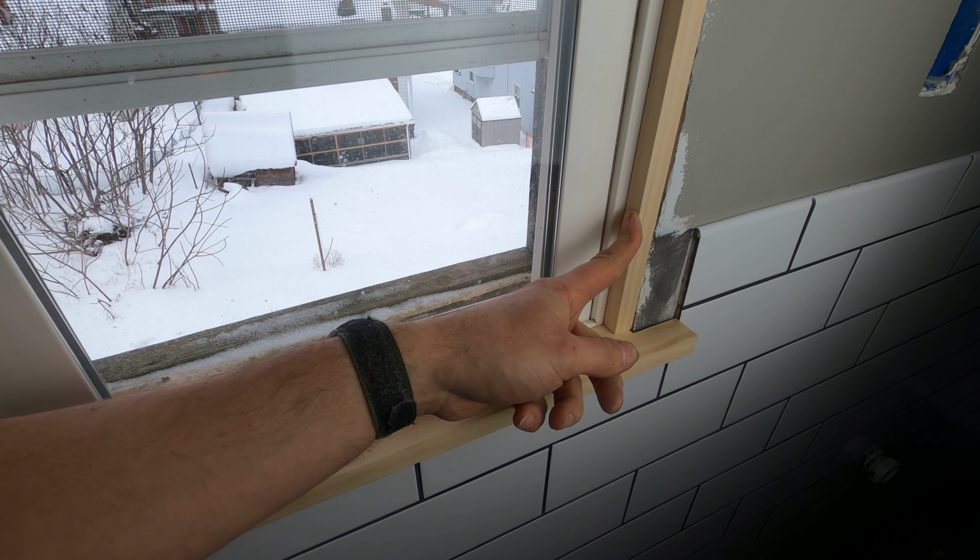On the other side of the doorway, I bring out the wall with 1/4-inch wood strips. Then I cut the hole out in the middle of the trim board for my light switch with my oscillating saw. After a quick sand, I nail on the other side piece of trim, followed by the lintel.